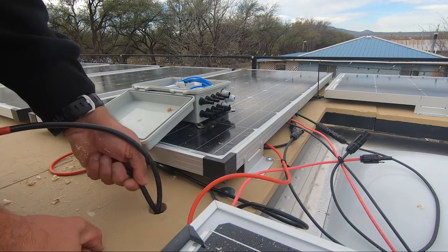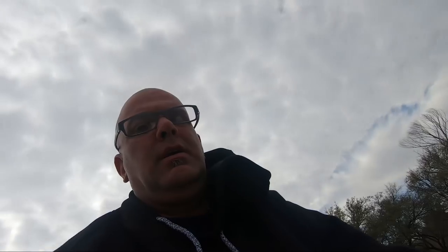Now I have plenty of wire. When you're working with DC electricity, the biggest wire you can use is the better. These are eight-and-a-half-foot pieces of wire, and I'm using four-gauge wire to minimize any loss. In full sunlight we're producing 1,500 watts of power here, so I want to get it there as efficiently as I can.